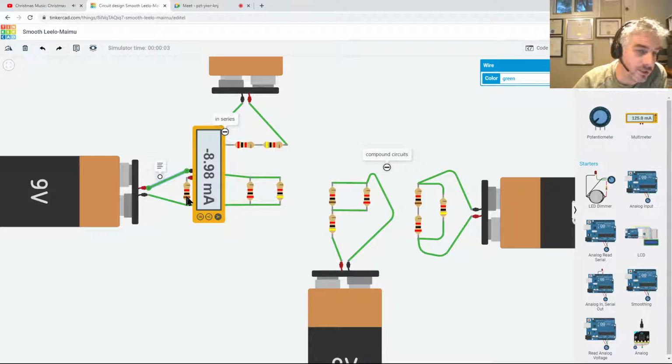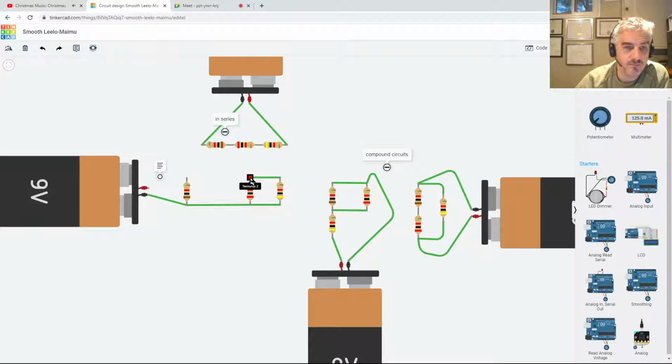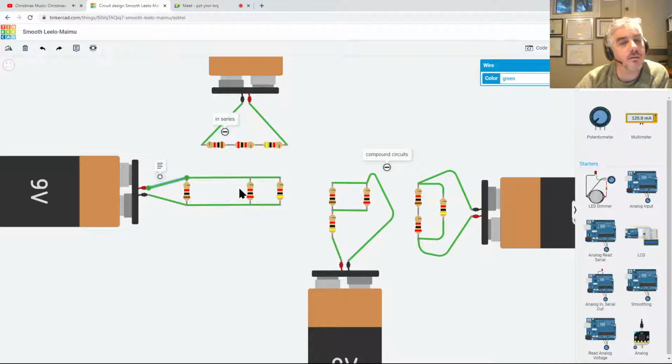So the lower the resistor, the higher the current. It totally makes sense. Okay, so I was reading, I forget the numbers, 2 here, 4, and then 9 here. So you take notes of all of that, and you make a nice chart. If you do it well, you should notice that your IT will equal I1 plus I2 plus I3. Okay, so series and parallel.